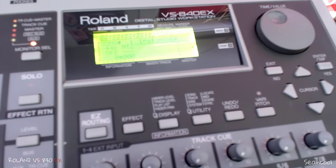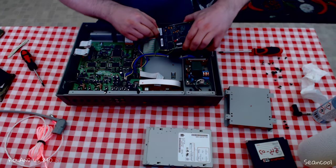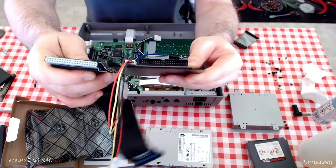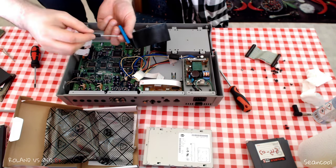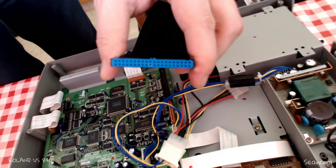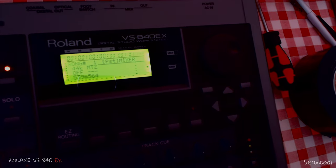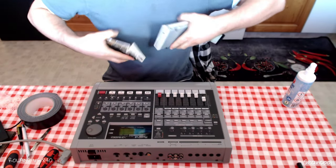I bought a compact flash reader from StarTech and it was a nice experience to check it out. I know for IDE drives you sometimes need drivers, but here using the StarTech compact flash card reader and writer, you can install it in many ways. I glued it onto the metal plate, and the IDE cable was not a full port cable so I had to drill a little hole manually so I could connect it to the Roland port. Instantly the compact flash card reader was recognized and I could format the compact flash card — everything seems fine.